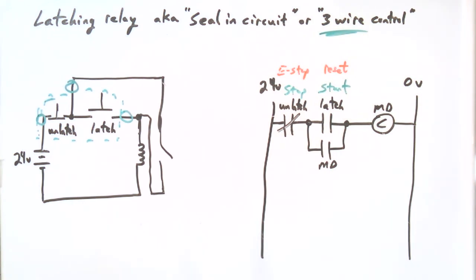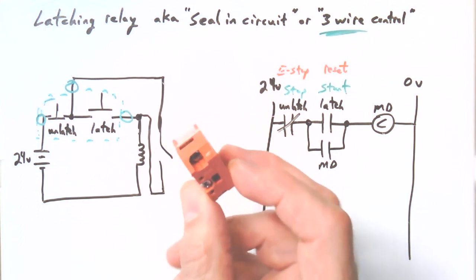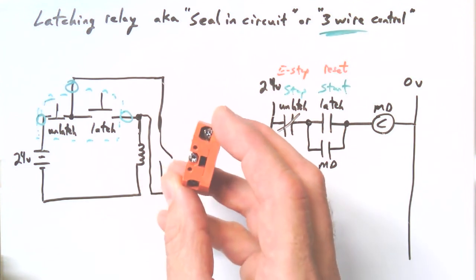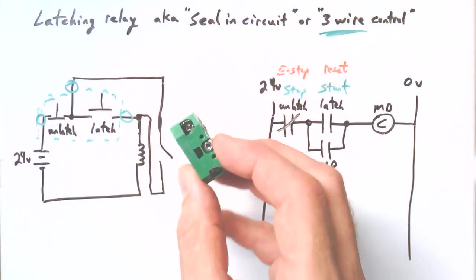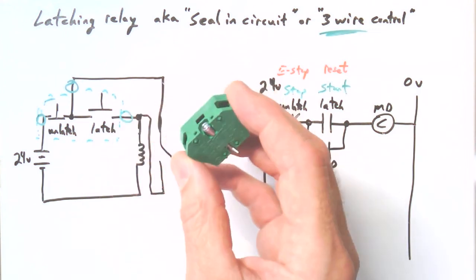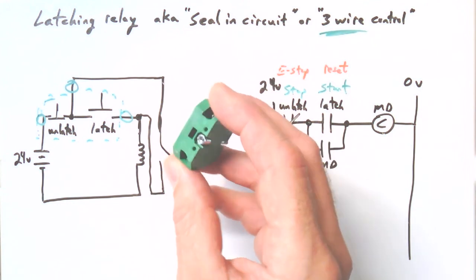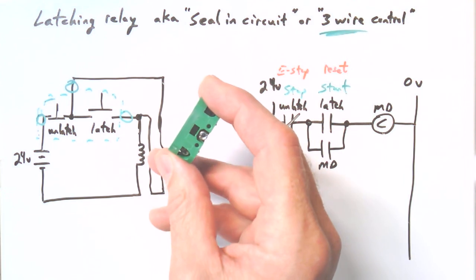And one last thing, while we're talking about the general mindset of industrial control design, you're always going to use normally closed contacts to stop things. Like the e-stop circuit, it uses the normally closed contact, because it's probably the obvious choice. But it's absolutely important that you would not use a normally open contact to send a signal to stop something. Because the problem there is if a wire was loose or a wire broke or your signal path just did not have integrity, something came disconnected, then when you go to hit the panic button to stop things, that signal won't get through because a wire came off and you didn't know it.